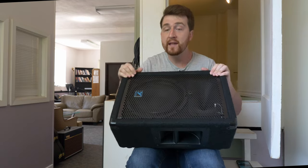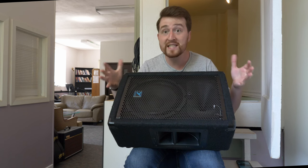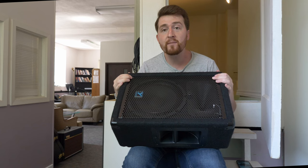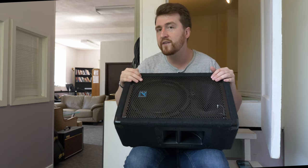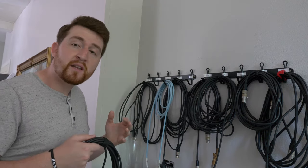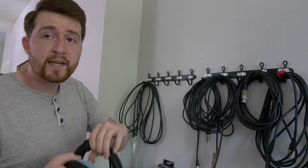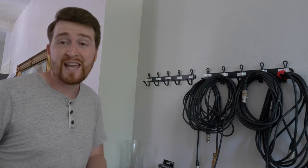We only had one floor wedge, and when you have multiple musicians all trying to hear themselves, it's a lot harder to share one monitor — especially when some volunteers have hearing impairments. This massive wedge was also huge, and in a small church with limited stage space, we couldn't afford to lose that real estate. If one musician wanted to be louder, it would be louder for the entire congregation, essentially acting as a third PA speaker bouncing off the back wall, creating a weird delay effect and muddy low-end. The solution was going digital: enough channels, proper gain structure, multiple monitor routing, in-ear options, and no more bulky floor wedges. It sounded like a win-win.